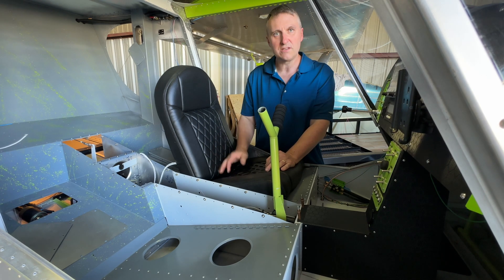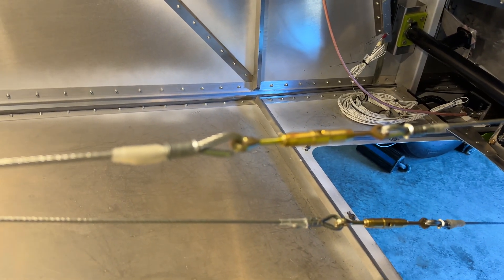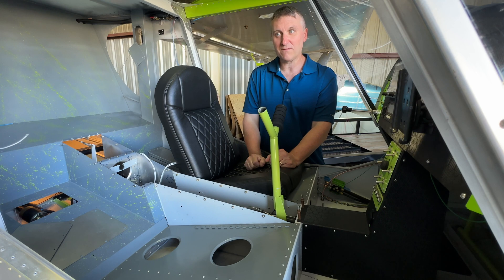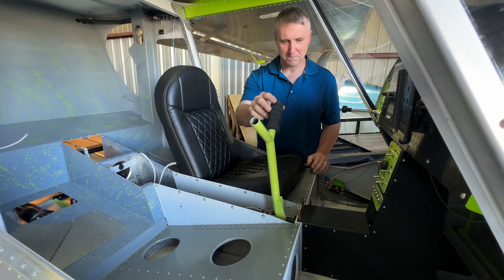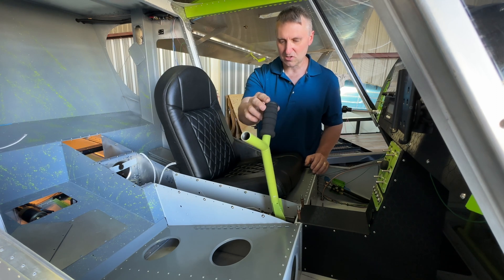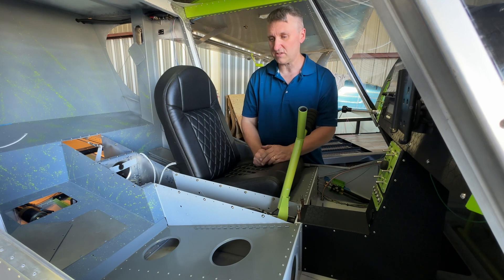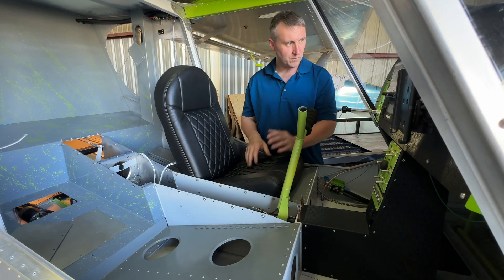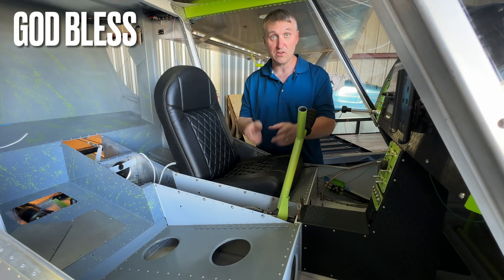I'm not going to touch anything. The only thing I didn't do is I didn't safety tie the turnbuckles yet. The tension I got pretty much set at minimum, as far as my homemade tensionometer goes. I'll wait for the one I get from Aircraft Spruce whenever I get it to get more accurate readings on the tension of the cables, just to see if I can take a little bit more of the spring back out of the system. Bungee cord's in place. Next thing as far as the elevator's concerned, I have to do the trim tab — I haven't got that wired or anything. I'm going to do that once I mess with the instrument panel and my pitot-static system. But for now, I'm going to move on to the rudder cables. We'll see you next time.